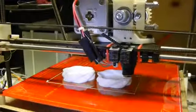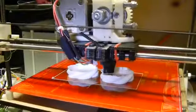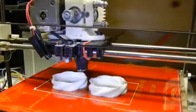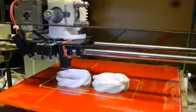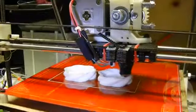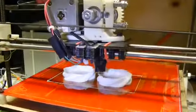On the right side of the extruder you can see the tension block with 4 springs. This block pushes a bearing against the filament so it gets pressed firmly against the hobbed bolt's teeth. The hobbing on the bolt is a threaded groove around the diameter of the bolt that I did myself with a tap. It acts like a worm gear so that as the bolt turns, the filament is pulled past the bolt by the hob's threads. It's a very simple and reliable method for moving the plastic through the extruder.